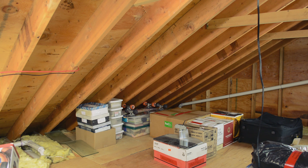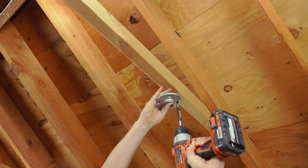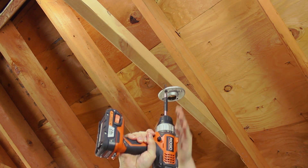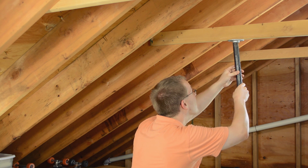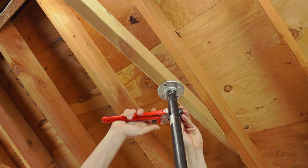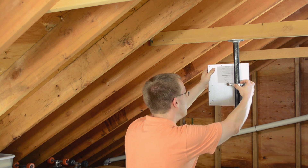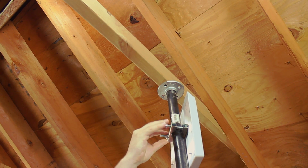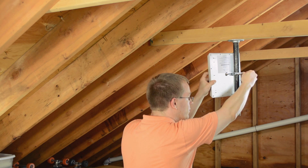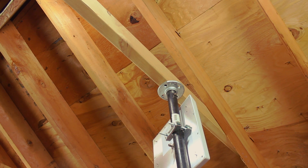Here's my attic. My plan is to install the mounting pole here on this collar tie, run the cable along and across the rafters, and then down a plumbing chase to the basement. First, I'll install the threaded flange onto the collar tie using regular inch-and-a-half drywall screws. Then the steel pipe gets screwed onto the flange and tightened down firmly. Finally, the antenna slides onto the pipe. I'll hand tighten the nuts on both sides of the pole clamp evenly, which is enough to keep the antenna from slipping down the pipe. By tightening down only one side using an open-ended wrench, I'm still able to rotate the antenna without it sagging out of plumb.